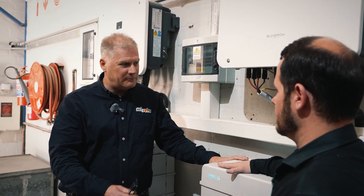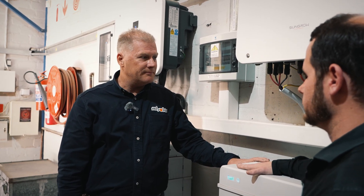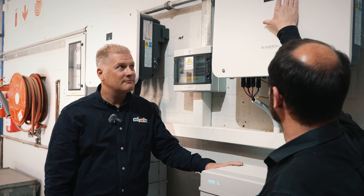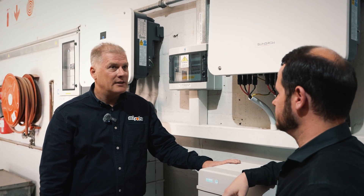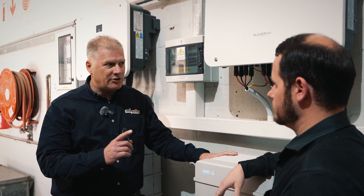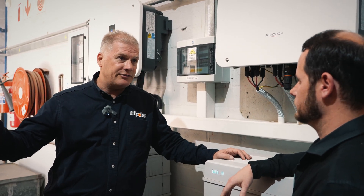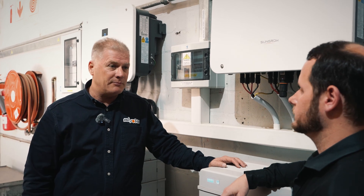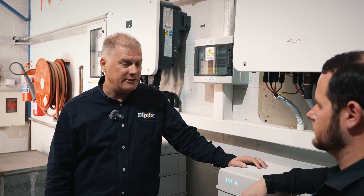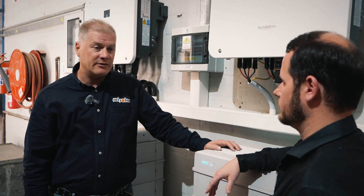For us, we've done many, many of these since then — bigger, up to six units — which has been a good relief for us. How many kilowatts peak of PV do you have installed here? This has got 42 kilowatts. So we actually started off with one unit and two batteries, but the machinery had changed. It's a manufacturing plant for roof trusses and they bought extra equipment, more saws, which used a bigger startup current and one of them was struggling. So we put the second unit on, which resolved that issue, and now it works like a charm.